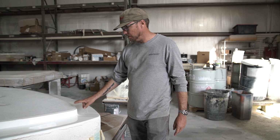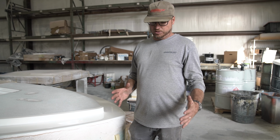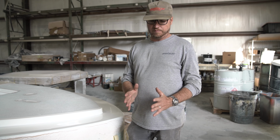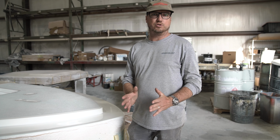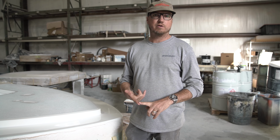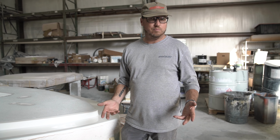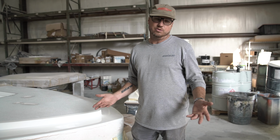And we're gonna start that division with an 18-foot Versatile. We took our aluminum Versatile skiff, we stretched the transom 6 inches and made the bottom of the boat 2 inches wider. And we did that to handle the Mercury 60R weights and the Yamaha F70. And then if you want a Tohatsu 60, you're gonna be even better.